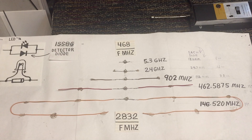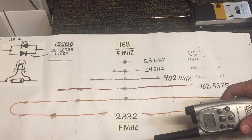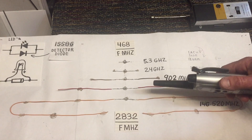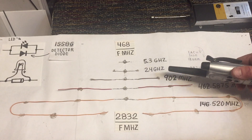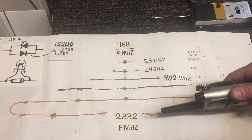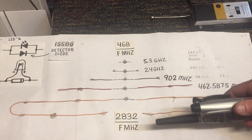When manufacturers build TV antennas, they don't have the option of designing an antenna that's ideal at just one frequency, because the television spectrum covers a whole multitude of frequencies. You have to build an antenna that picks up several different frequencies, and it's always a compromise. Nevertheless, these engineers spend enough time and come up with some pretty good antennas to cover a variety of different frequencies, even though the antenna isn't designed to work ideally at just one frequency.